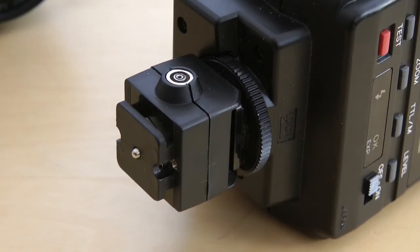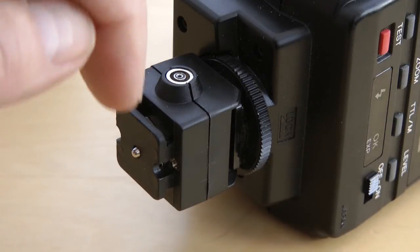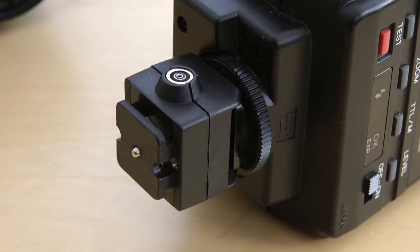If you want to use external flash guns, there's a plethora available on eBay, but what you have to be careful of is the trigger voltage — the voltage between the tip of the flash unit and the ground terminal. On some early flash units, the trigger voltage derived directly from the trigger coil and could be up to 300 volts. The internal circuitry of your FZ150 is only enabled for very low voltage. If you connect one of these older high-voltage units to the hot shoe of your FZ150 you will probably fry the internal thyristor. Consult the flash trigger voltage from one of the flash strobe sites — I'll try and put a link in the video — to verify whether the trigger voltage is low enough to use on the FZ150.